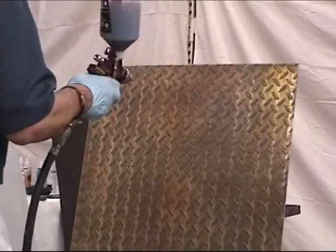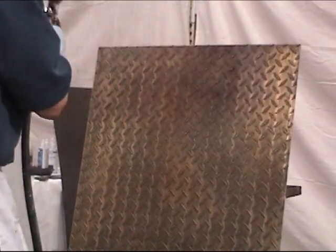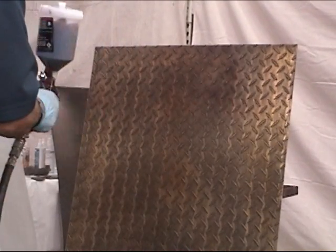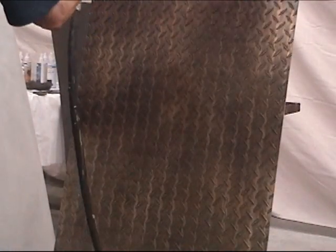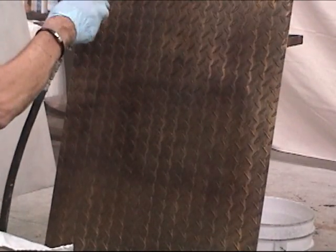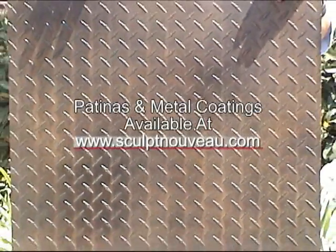Next, we're putting on the brown patina stain. This is a mixture of our new clear coat and our solvent dyes, so you're getting two things at one time — a seal coat and a color. If you're using the brown patina stain, we sell it both in a spray can and in containers such as four ounces, eight ounces, and 16 ounces. I would dilute it at least 30 to 50 percent if you're going to spray it from the can, because it's very, very strong.